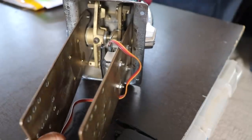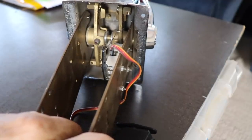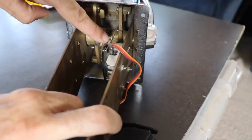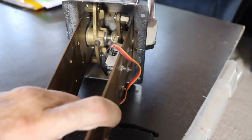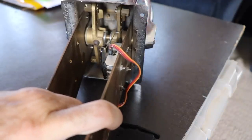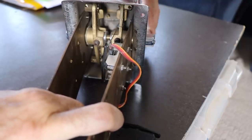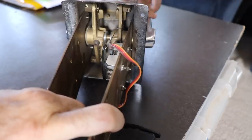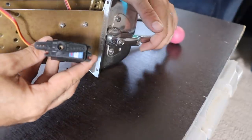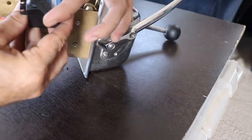This gives you an idea. When you operate a lever on these control boxes forward and back, they're basically tipping an arm like so. You can see here, we've built a couple of control rods for our test system onto a servo tester. So as we move the lever back and forth, we're moving that servo tester back and forth as well. That was sending an electronic signal down to the engine room to say move a servo in a certain way. It passed through a cable, and as we move that, the servo would just rock over to suit wherever it needed to go.